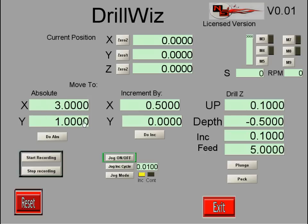I have two ways to make movements. I can make an absolute move by entering numbers in this pair of DROs — for example, if I want to move to X3 Y1, I simply click the "Do Absolute" button. You'll notice the DROs move; the machine has just moved to that absolute location. Now if I want to drill a hole there, I do a simple plunge drill — the drill plunges down at the set feed rate, hits the bottom, and comes back up.